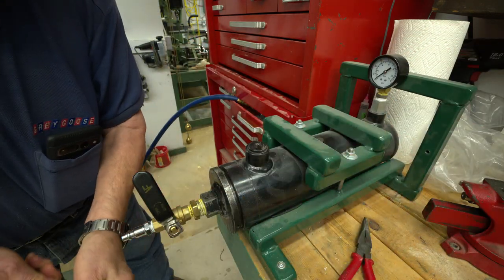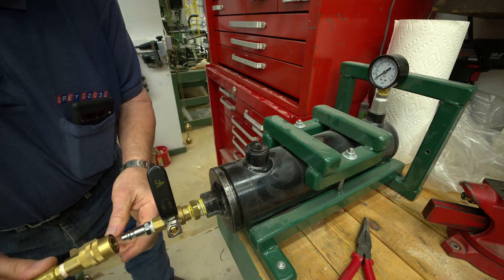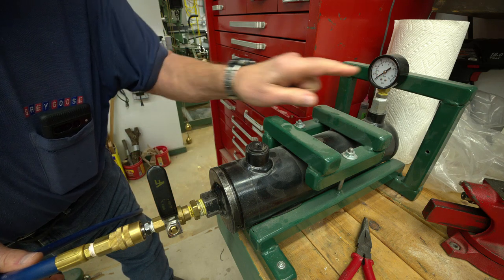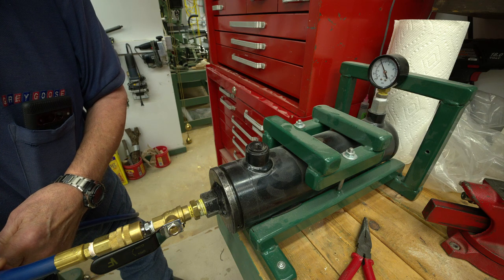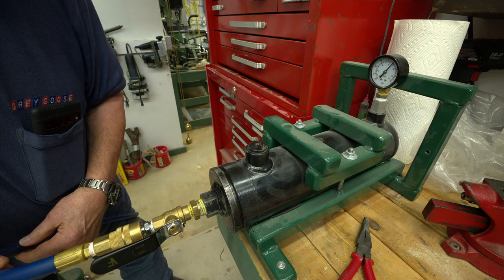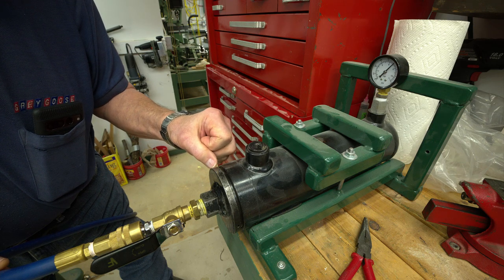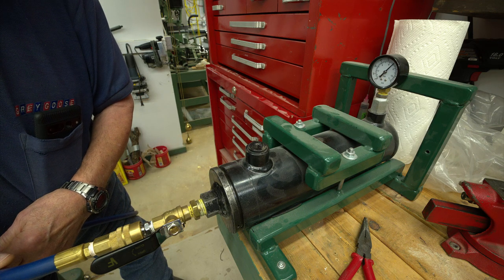This does not have to be real tight — the o-ring will self-seal. I'm going to take my air supply and just hook it on here. When I open the valve and allow the air to go in, you'll see the gauge go up and it will neutralize with whatever pressure is in my tank. Right now I'm up to about seven bar — the air bubbles inside there will be compressed in volume to one-seventh their normal volume, not size in diameter, but volume.